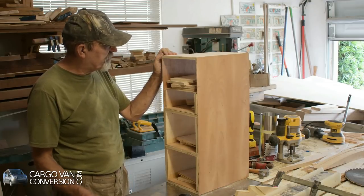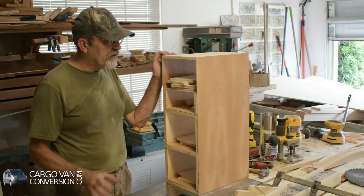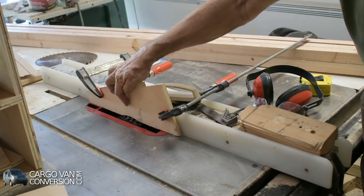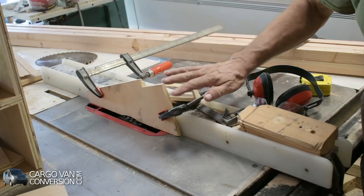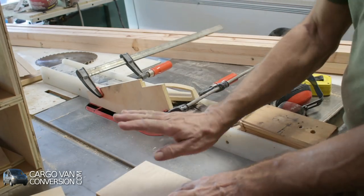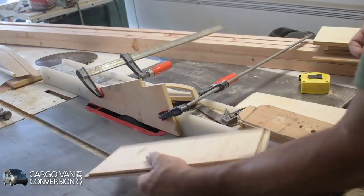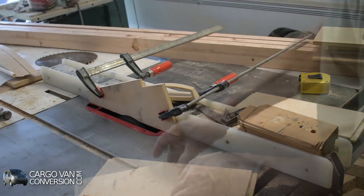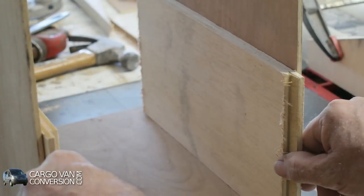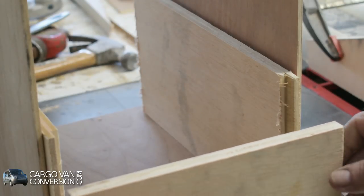This is the third part I was working on — a little box with drawers for inside the workbench so I can store at least some basic tools. First I installed my dado blade set in my table saw, made a few adjustments for the depth and size of the drawer, and then cut the rabbets. Now I've got the two sides of the drawer cut to length, but the width of the front and the back needs to be adjusted.